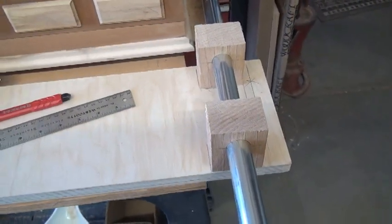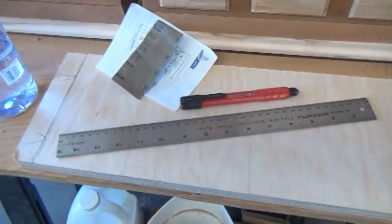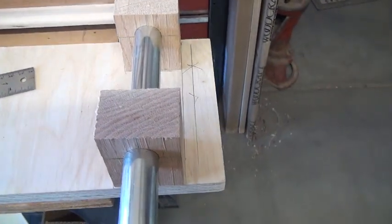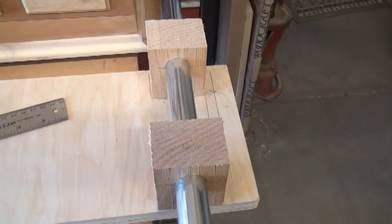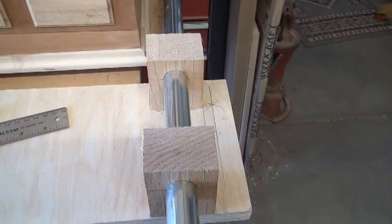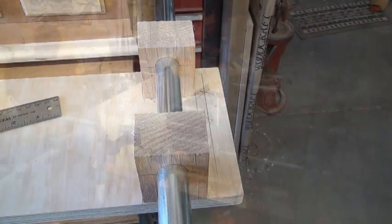Okay, so I cut a 3/4 inch piece of birch, 7 inches by 24, and squared the line. I used the factory cut side just to be sure. I had the Shopsmith set back up on the saw system. And I'm going to probably use Elmer's glue and let it really set good, and then put the screws in later, and then drill the holes for the set screws.